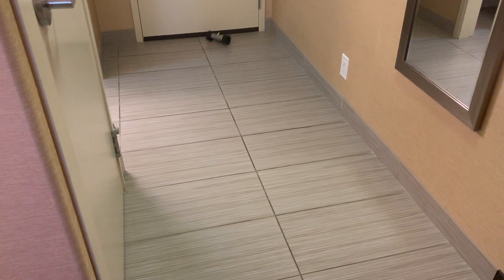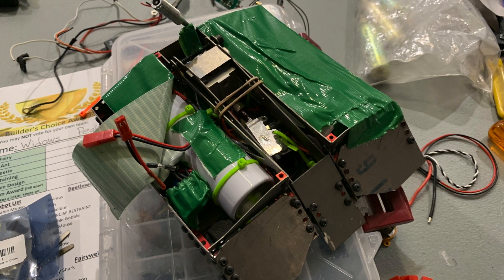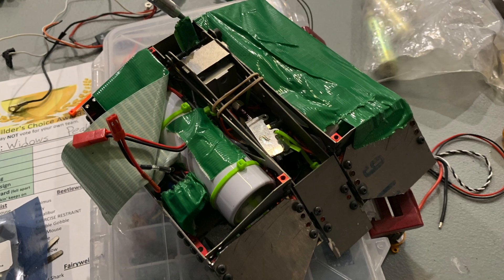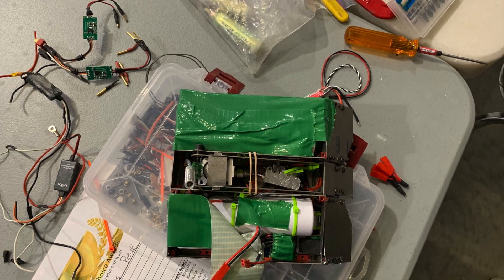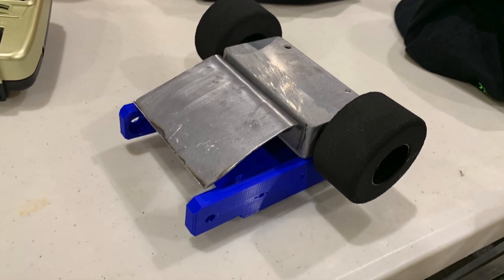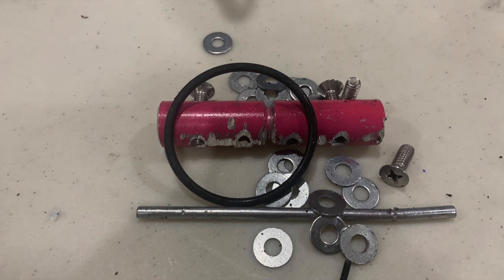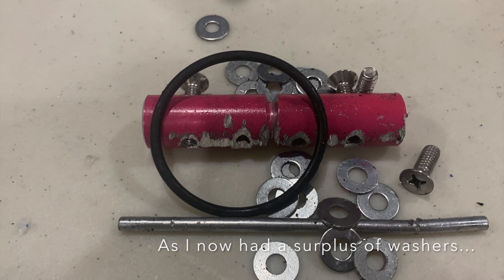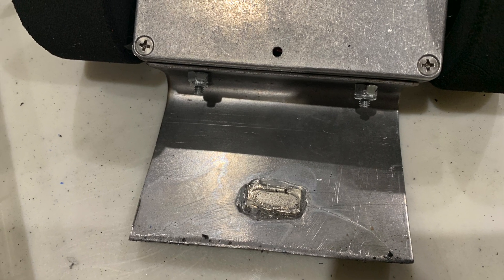With Blastwave now out of the competition, I just had Stompbot. Stompbot was fighting the Highlander, built by David from team Small Robots. Highlander is a pneumatic flipper and a pretty good one too. My best bet in this match was to win a pushing match, so I switched from the higher-speed motors to the original lower-speed, higher-torque motors. We also switched off the wedge to get lower ground clearance to aid in the pushing battle. The new wedge was a bit too steep and long and the robot was getting hung up on it and the wheelie post, so I chopped off the end of the wheelie post. Brian from team Buttsbots suggested I use one of his magnets and glue it to the front of the robot, which helped magnificently.